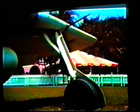The landing gear was designed by me. I prototyped it out of wood. I used electric screwdriver motors, driving a 1/4-20 threaded rod, and it lifts the wheels, which, the whole wheel package, each one weighs about 1.5 pounds. I also prototyped the scale tail wheel, and then I machined all the parts on my milling machine. Look at the details.